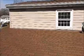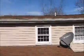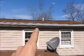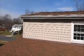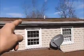Okay, I'm now down on the lower roof. Now, I wanted to show you something else that's also causing a leak on the lower roof. All right, the downspout is over here. The gutter is lifted up at the highest point in the middle, then it slowly but surely drops down to the left. So the gutter needs to be lifted up high over here, drop it down a little bit in the middle,